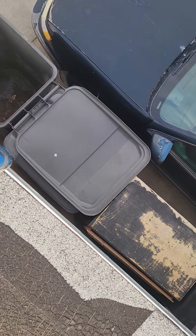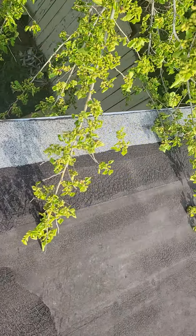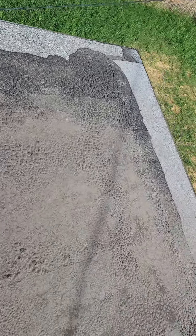You've got to take this up, throw it away, and here's a crucial part — take this roof and go over the top with a torch down. I would keep the same drip edge, it's called gravel stop. I wouldn't put anything over it, because every time you put something over it, you're lifting up the outside to where the water doesn't drain.